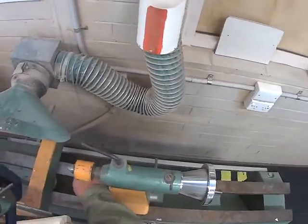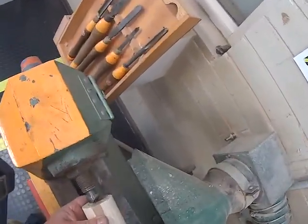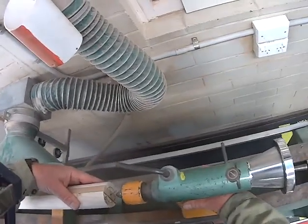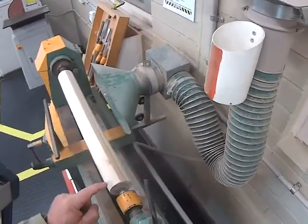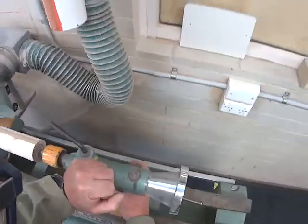Will this move? Yes it will — it's not locked. Again, where you put the saw cuts goes into the live center so it's got something to bite into. Hopefully that'll work. We've got to go back a bit further, slide it back a bit further. Tail stock slid back. Dead center is now hard up against the wood.